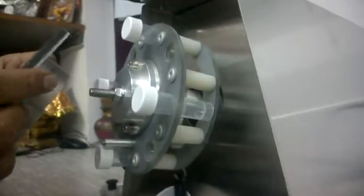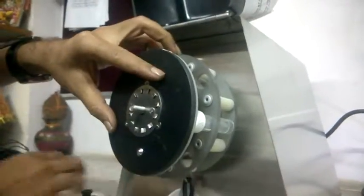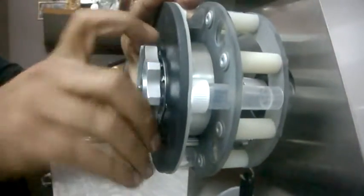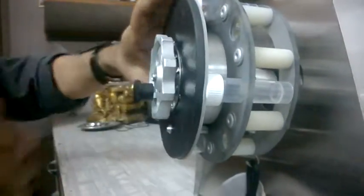The 4 vials are loaded. Using the guide, slide the 7 ml vial holder into the motor. The lid is slightly different for the 7 ml vial holder. Again using the guide, slide it on. The locking is the same — tighten the aluminium knob clockwise and then release the pin. Hand-tight is enough. Once the pin is released, it will lock.